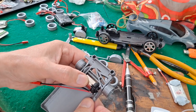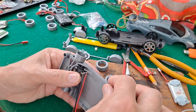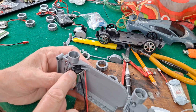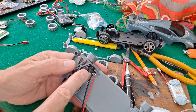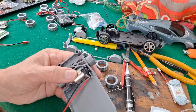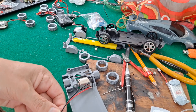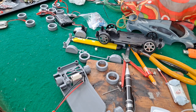That's a little bit loose — that will be where my layers of PLA didn't settle properly. It's printed that way up and somehow it was supposed to print on fresh air there without any support layers. It's only a tiny bit out; I can soon adjust that with something hot and just melt it a little bit. Anyway, that's in — let's give it a try. Okay, that appears to be working.